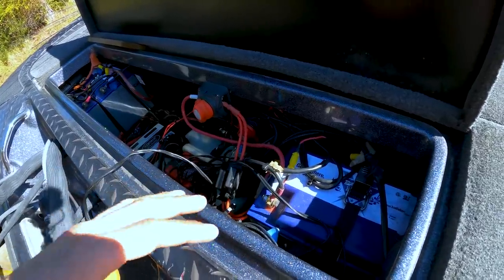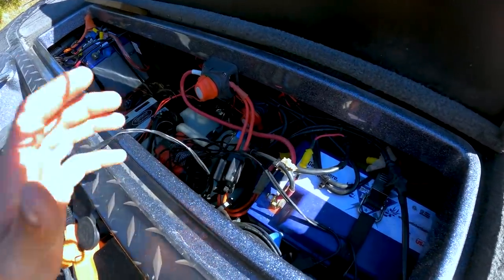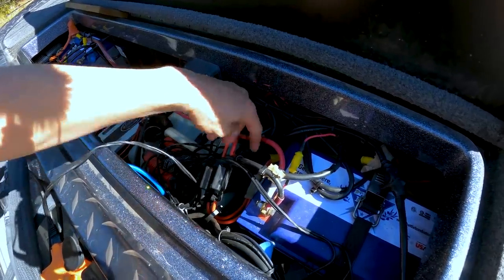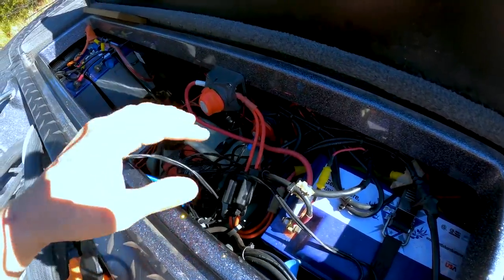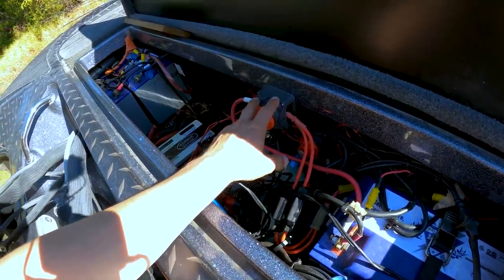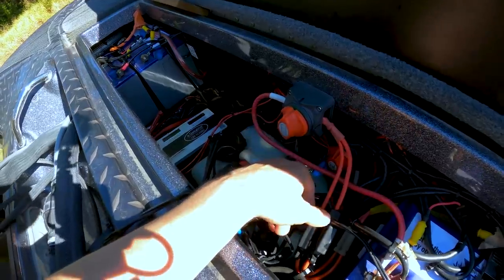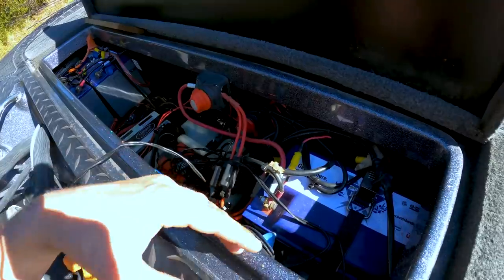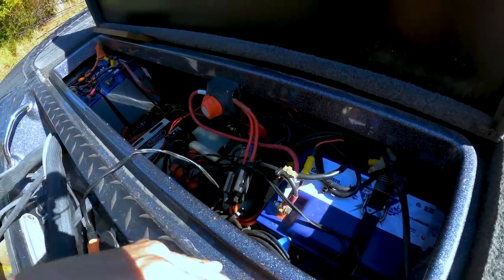So I've actually run, and Nathan Martin at Sea Clear Power helped me to do this, because you can see his Sea Clear harness right down here coming off of there, right there. So he ran a master power switch. I have my graphs and my Active Target hooked up to my trolling motor batteries, and then everything else, like normal stuff, cranking, goes to my cranking battery.